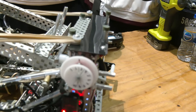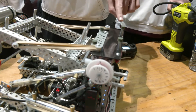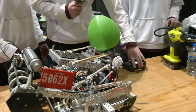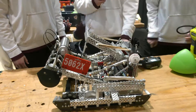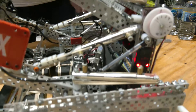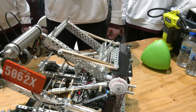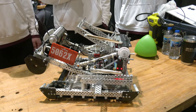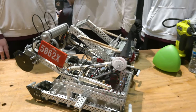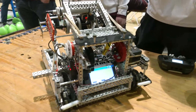We have these rubber links up here where the match loads go during skills. During skills specifically, we put them in there — they're at an angle with a trap — and then we shoot them like that. Previously we used a limit switch to make sure the catapult would go down to the right height, which catches the catapult at the right height to stop it. Now we just have a button to move the catapult at a constant speed as long as you're holding it, and that helps us go as fast as we possibly can during skills matches. We shoot from just one arc for skills, but we have the option to shoot with the catapult in matches if necessary — we don't really find it necessary in skills because the grouping is a lot better with this arc, and it's so much quicker too.